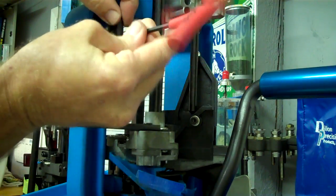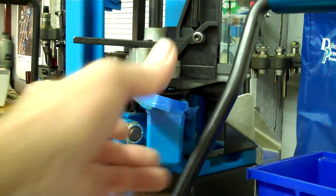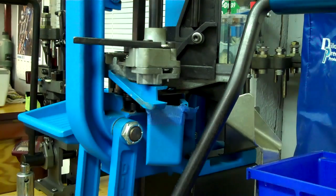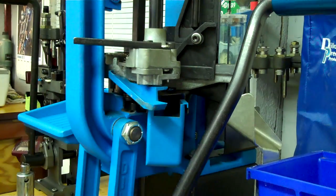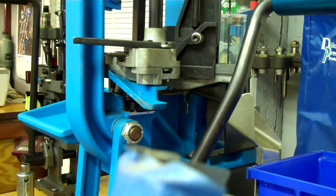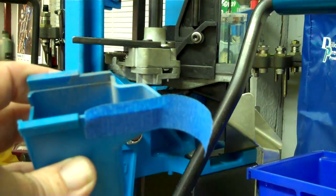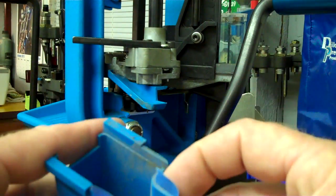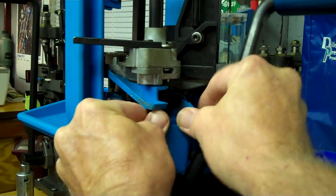I'm going to take this block out — the one that cycles the primers — and I'll explain that in the next video during setup. A caliber change is always a good time to do some house cleaning. You can see all that tape residue; I'm going to leave that because I'm adding a new piece of tape there — that's one of those little Dillon tricks. On the old primer catch I'll re-tape that as well. That piece of tape acts almost like a little rubber gasket and keeps the machine from spitting powder and debris all over your floor and bench. The new piece of tape with the sticky side showing is fine — powder and primers will stick to it, and it conforms like a drawer to fix the problem areas.